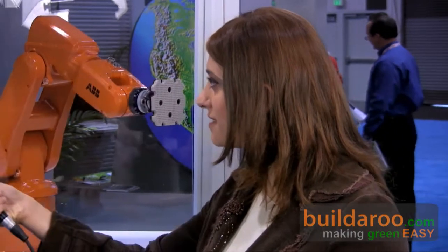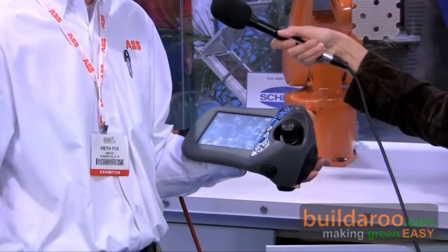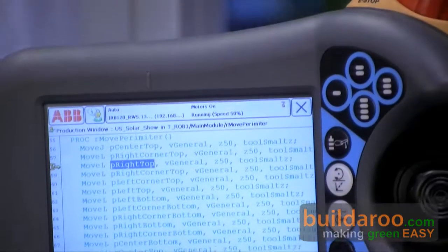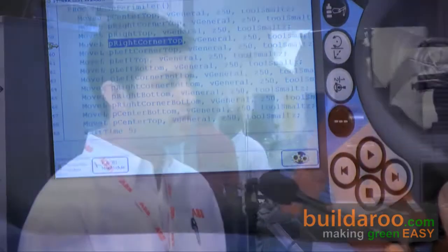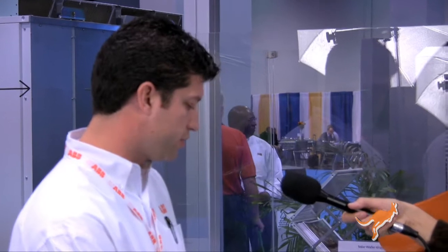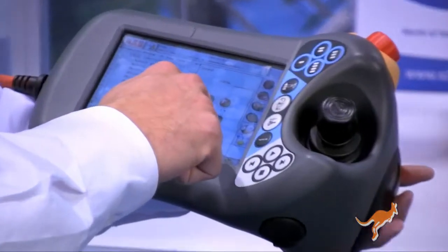Can you show us how this works? Sure. A simple application operation for the robot is through the teach pendant. The teach pendant is a graphical interface. We utilize the same teach pendant on all of our robotic applications, so any customer that uses a larger robot will be very familiar with this application as well. What I'll do for demonstration is just increase the speed 100% with just a few simple clicks, and we just increased the robot speed by 100%.